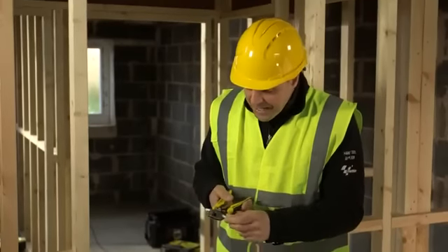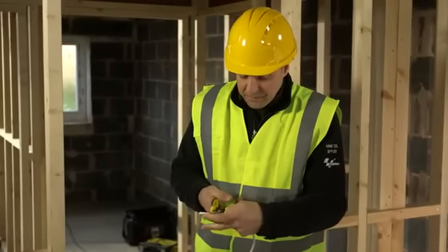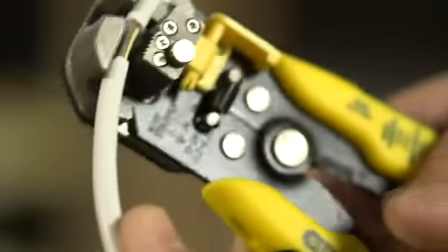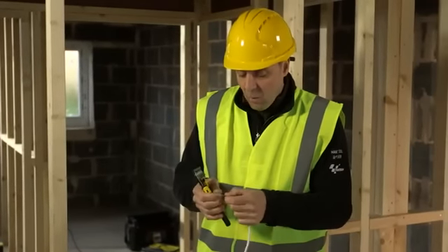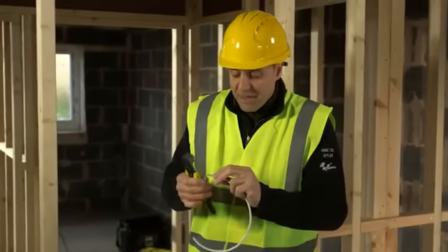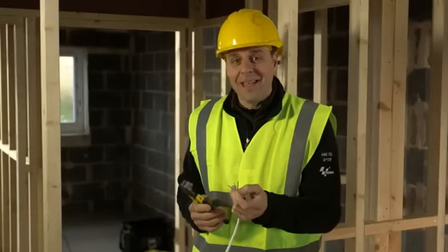There's very little wastage and they're very comfortable, very easy to use. In the business end of it, you literally just put your cable — whether it's flat or round PVC cable — into the stripper like so, pull it back, and you've taken off the outer insulation. Once you've got the inner cores, just make sure they're flat as they enter the jaws over the anvil, pull it back — cables are stripped. It's really that easy.